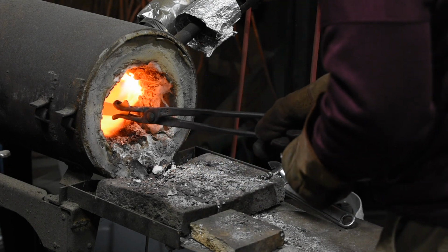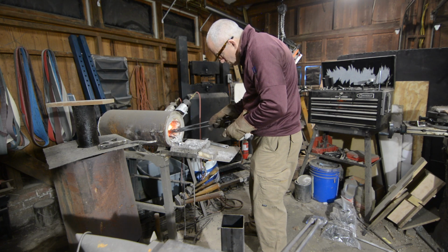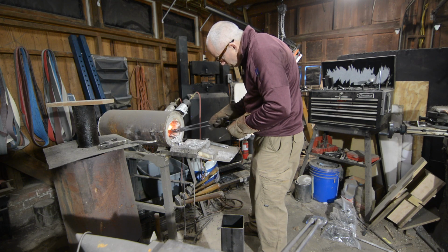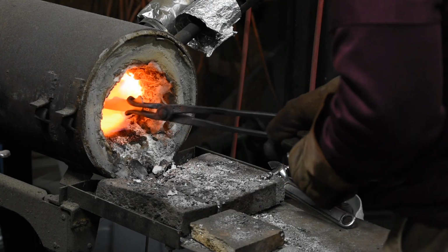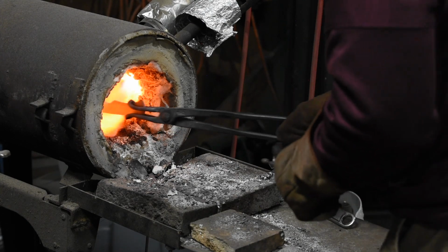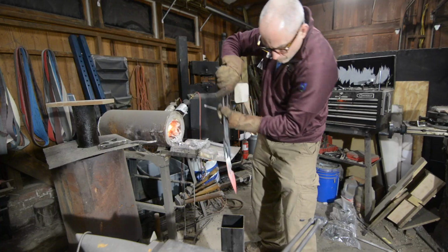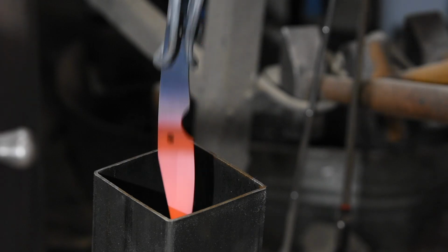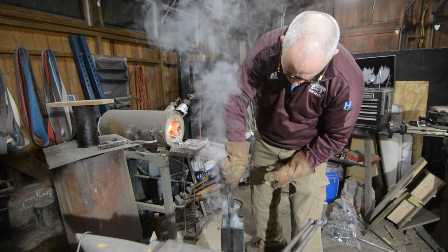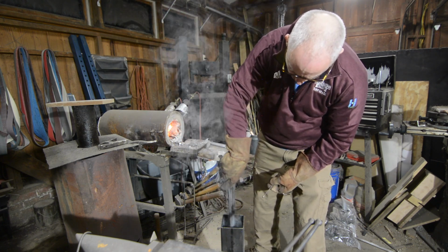It's not that hard. I'm tapping away with a little magnet on a stick. When the steel reaches about 1425 degrees, 75 degrees below my target, the steel becomes non-magnetic. So I know that I just need to get the steel a hair hotter and we're good to go. Boom, into the oil. Will any oil do? Pretty much. Now, this is a fancy industrial quenching oil, but I often use warm peanut oil and it works just fine too.